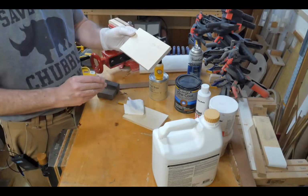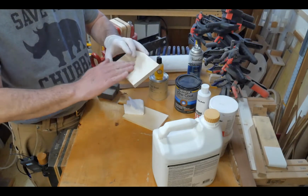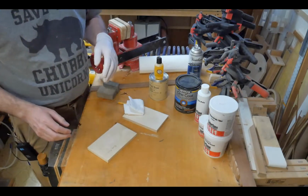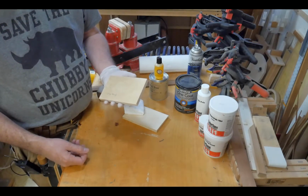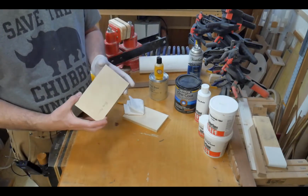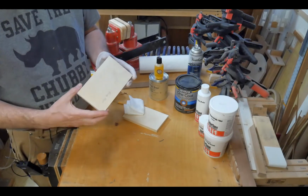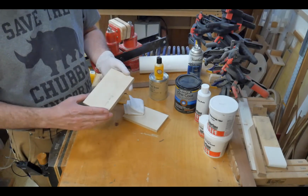Now you can't see this, but you can feel it: the grain is now raised. Wood likes to absorb water, and when it does, it swells a little bit. So even though this was pretty smooth when I started, it's not now. It's a little rougher. Once in a while you'll see people really over-sand guitar bodies before they finish them. I've actually watched students go down to 400, 600 grit to get them just glass smooth before that first coat of finish goes on. It isn't going to hurt anything, but it's really a waste of time, since that first coat or two is going to swell the grain a little bit. Put 1 or 2 coats on and then sand it back with something finer. Before you put the finish on, there's no point in going beyond about 220. Anything finer than that is a waste.